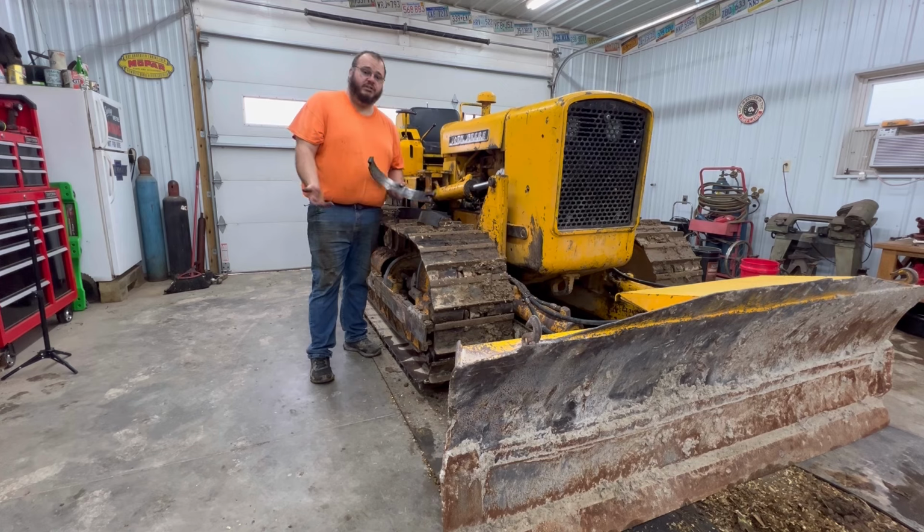Eventually, I'm going to have to do this again and put new drums and everything on it. It's just the way it's going to have to be. I don't want to put the money into it right now. The only reason we went with these aftermarket pads the first time we did this was time. If you buy the aftermarket pads with the clutches, and we had them right here, the factory bands would have taken 2 weeks to send out and have come back in, and we just didn't want to wait on that. So that's why we went with these, and we found out the hard way.